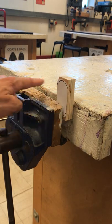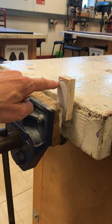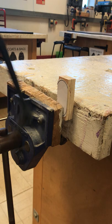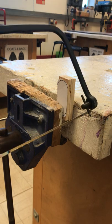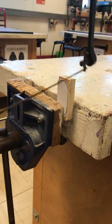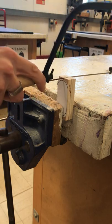Once you cut your straight line on each side, you're going to try and cut a curve. To cut around this part you'll need to do it in two goes — you can't do it all at once. It's all about taking your saw and as you're sawing to and fro, you're either going to roll it to the left or roll it to the right. Start in the middle at 45 degrees, and once you've got it moving you can start to roll your blade.